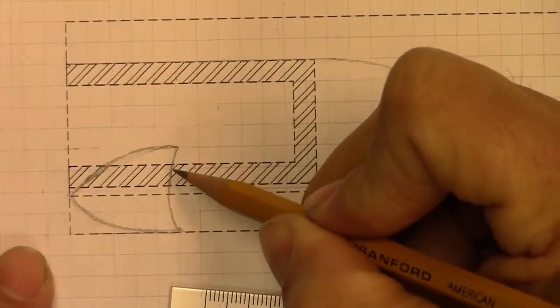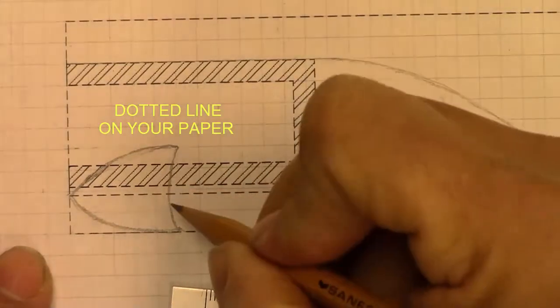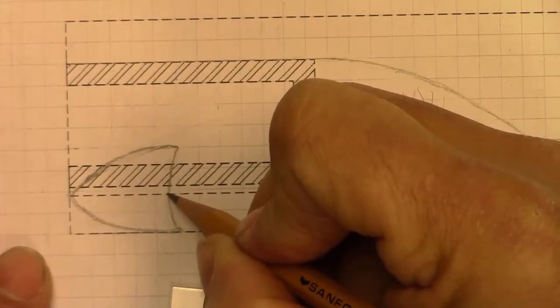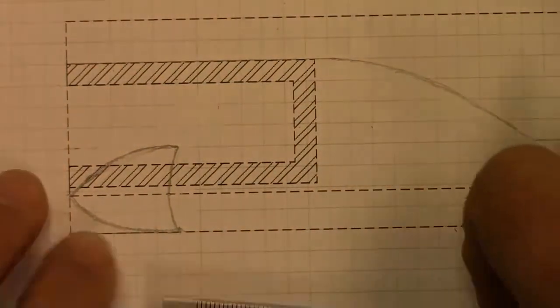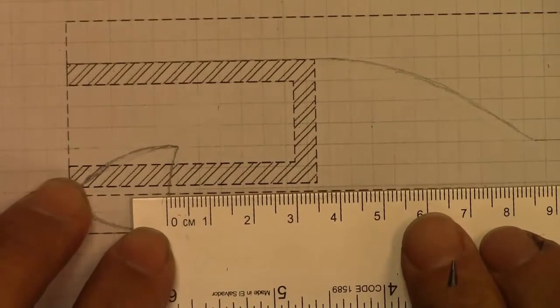Take where the airfoil intersects with this dashed line, which I'm gonna say, don't do this, I'm just gonna put a point here so you know what I'm talking about. This point right here is what I'm referring to. It's where the inside of the airfoil intersects with your axle line. You see that? Okay, you're then gonna take your ruler and you're gonna measure from that point